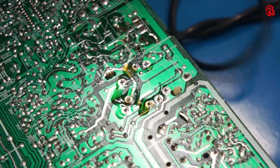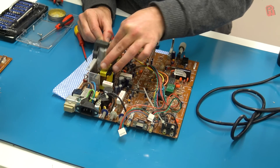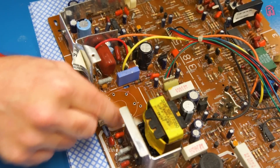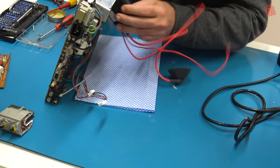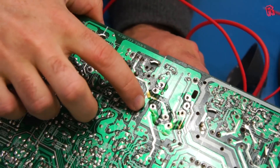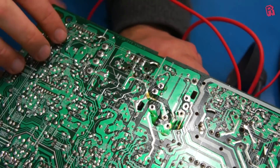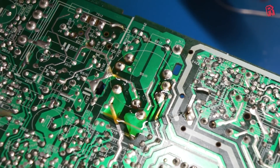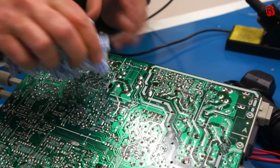There are also two plastic clips holding it in place. With a wiggle it was then removed. We'll give the area a clean with some IPA, then put our replacement in and solder it into place. I'm working on this at around 340 degrees C, and that seems to be plenty enough to get those big blobs of solder onto the pads. Once soldered in place, we clean up the flux and the transformer is in.